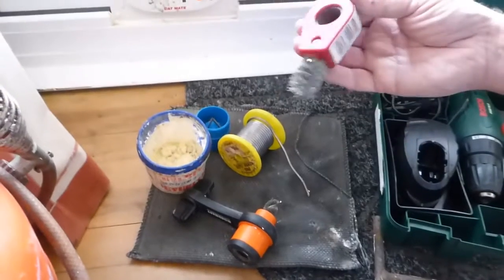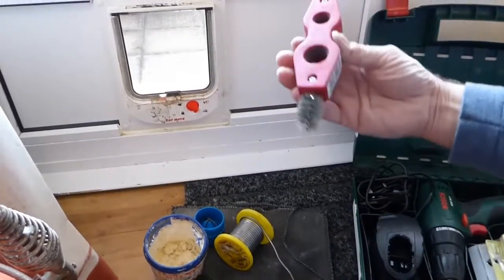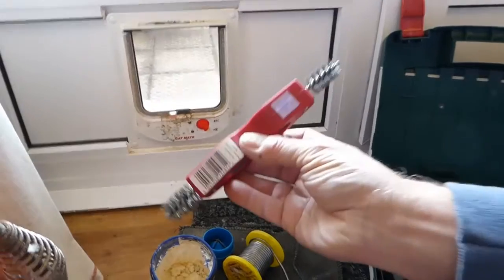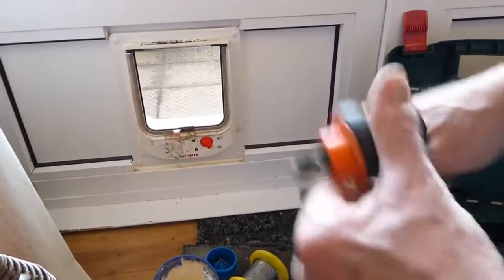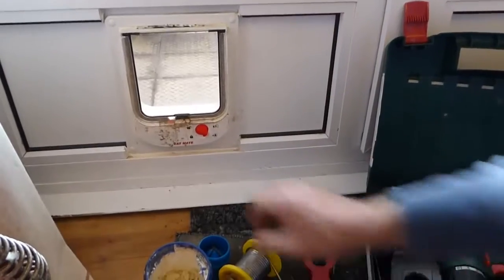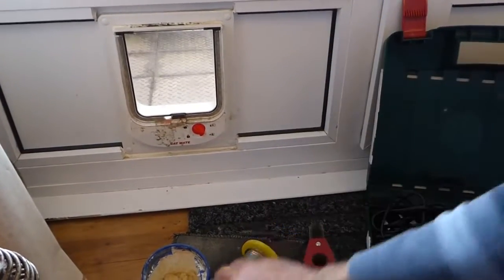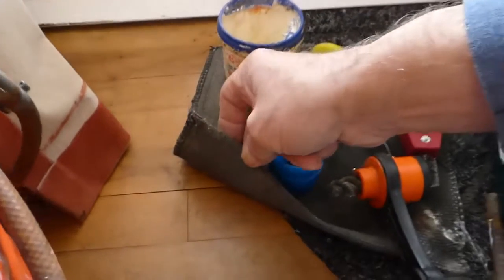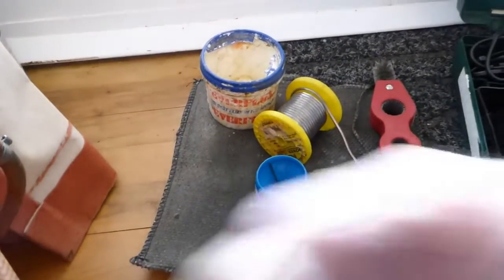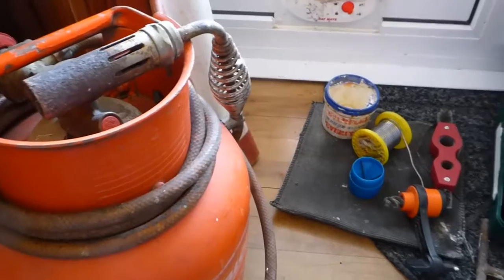You don't have to have a file — you can use one, but here's a pipe cleaner and reamer. It goes on the pipework, cleans the inside of the fittings and cleans the outside of the pipes. Very cheap — only a few quid, £1.79 actually. And this thing goes inside of a pipe fitting, twists around like that and cleans the pipe fitting out. This one reams the end off — it's got sharp teeth in there, put it on in, reams the inside of a pipe, makes it nice and smooth for putting the pipe on. Flux to put on the joints, and heat cloth to stand on so you don't burn any furniture or wallpaper when you're doing the burning. And obviously a gas bottle — I've got a big gas bottle because I do lots of it, but you can get little small containers with a little blowtorch if you're only doing a little bit.